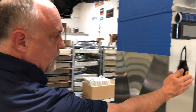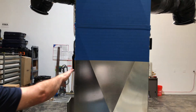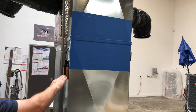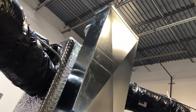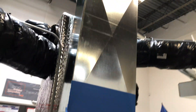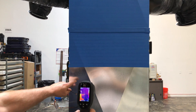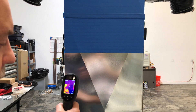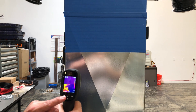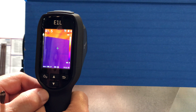One of the things that makes return air leakage really hard to diagnose — I've got a temperature probe on this side of the duct and another one on the other side, so I can get a mix of return air 1 and return air 2. The hot air coming in is on the left-hand side of the duct. Looking through the thermal imaging camera, we had to put tape on here because this duct is really reflective — you can see my reflection in it. You need to get the emissivity closer to 1, and the tape allows us to get a good temperature reading. You can see it's about 80 degrees all the way across that tape — very uniform in color.